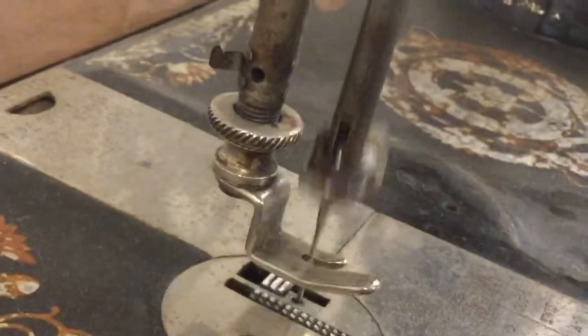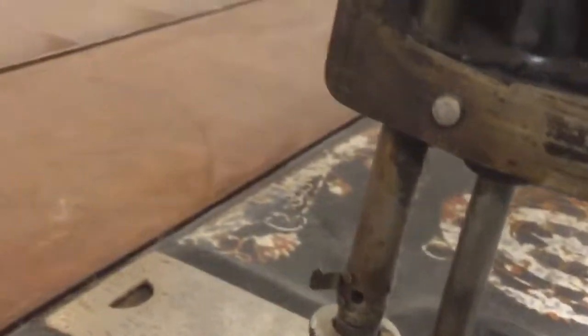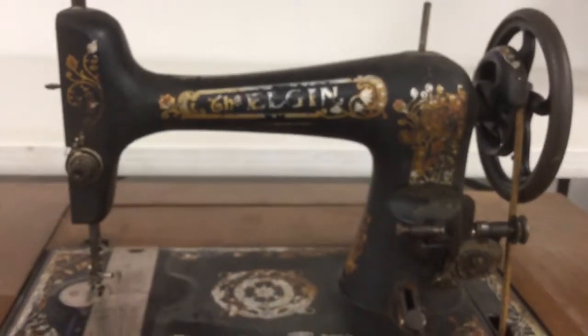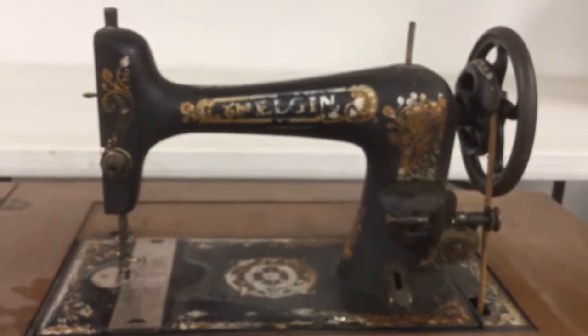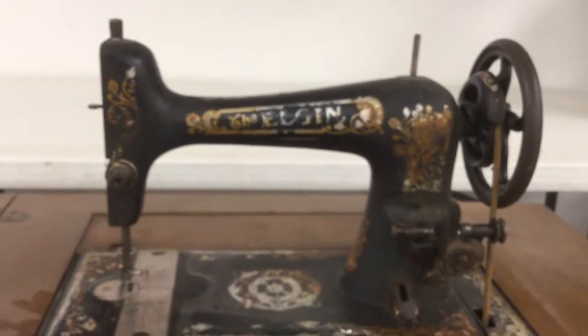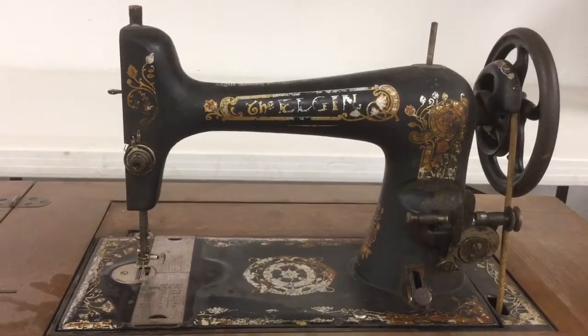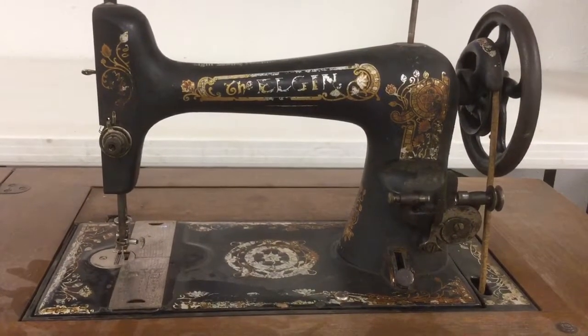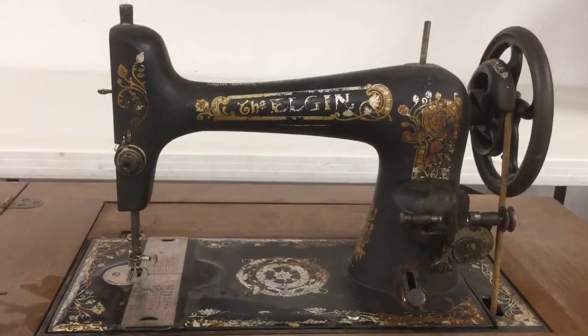So without any sliding blocks and Scotch yokes, it produces the up and down motion with the double take at the bottom of the stroke in a much more efficient manner, and it's probably more robustly built too. So a very interesting machine, the Free Sewing Machine Company of Rockford, Illinois, and a very efficiently made Singer 127 clone, which in reality has quite a few refinements of its own that really, when you look at the mechanism, makes it a much superior machine to the Singer. But Singer's massive marketing network assured their virtual dominance.